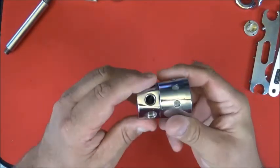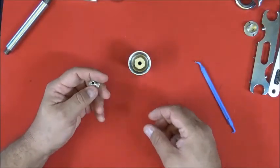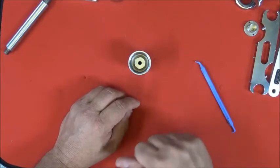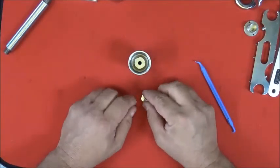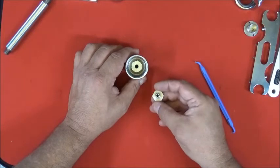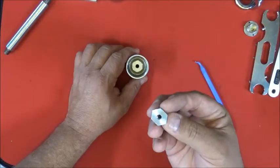Now, turret bolt. The turret bolt on the early regulators was made from chrome-plated brass. A lot of times that chrome-plated brass turret bolt was over-torqued when the regulator was reassembled and caused it to weaken. ScubaPro did an update and made them out of stainless and specified torque procedures, which you should be using anyway. I recommend that if the one in your regulator is chrome-plated brass and you don't know the history, replace it with a stainless steel one, just to be sure.